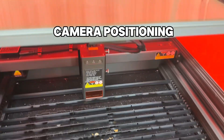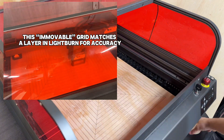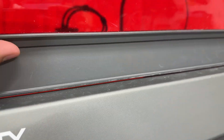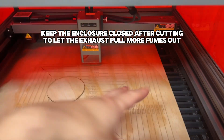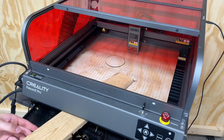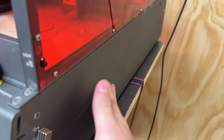Third, positioning is not perfect. Since the camera is a fisheye, once you get further from the center the placement won't line up perfectly. That's why I engraved a grid on a larger piece of plywood — I can push the piece into the back left corner and work from there since I have a matching grid in Lightburn. Fourth, imperfect fume seal — if you're cutting a lot of plywood, it's still going to smell like a campfire. The red panels don't have gaskets and there are gaps around the enclosure opening and debris drawer. The exhaust fan is also a little underpowered, so for heavy cutting I'd recommend also getting an air filter. Fifth, the closed frame design limits the workpiece size — with open frame lasers you could place the laser on anything, but now you're limited to what fits through the enclosure opening. For longer stock you might get a little extra length through the debris drawer, but it's not an ideal pass-through slot, so more front, side, and rear access would be nice.